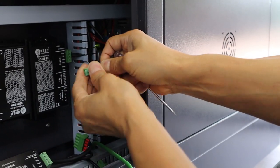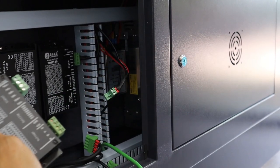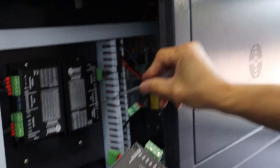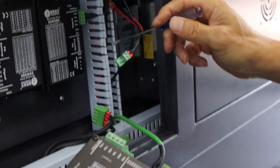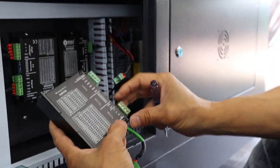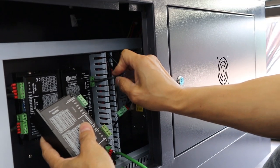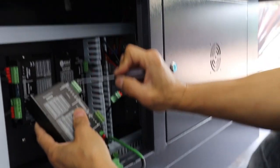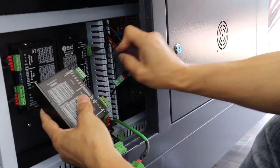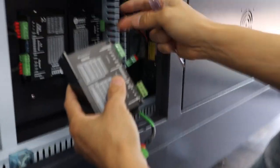Lock it up and make sure it doesn't come out. Now we have power sorted. This is the two-phase motor driver; the other is three-phase — you can see UVW for three-phase, and A-plus/A-minus, B-plus/B-minus for two-phase. For the signal part, you can match them: pulse positive, pulse negative, direction positive, direction negative — it matches. You don't need to do anything there. Also, regarding the ENA pins — ENA-plus and ENA-minus are for interrupt/enable: applying a signal will instantly stop and hold the motor, but we don't use them. Just leave them alone.